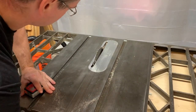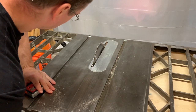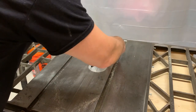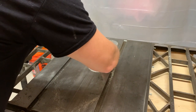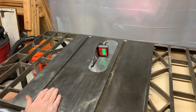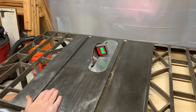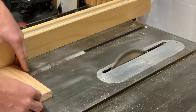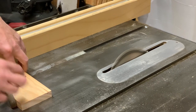Now here's where it gets tricky. In order for the miters to fit together perfectly and allow for all sides to make a complete circuit, the blade has to be tipped to 22.5 degrees off of 90. If the table is 0 degrees and the saw blade starts at 90 degrees, the blade needs to be tipped to 67.5 degrees. If you think it wouldn't matter much if you were ever so slightly off, you'd be wrong. Every miter connects to another miter, so any deviation from the plan is automatically doubled for every joint. Since there are eight joints, this adds up pretty quickly.